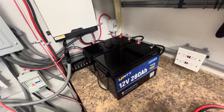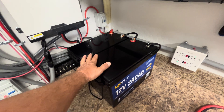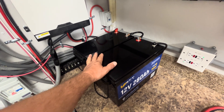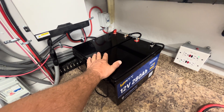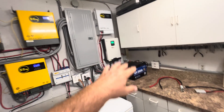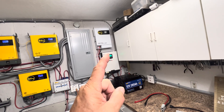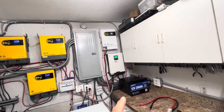A 7-kilowatt setup would be enough for me to run my garage overnight and keep it at 76 to 78 degrees. It was 114 to 116 degrees outside yesterday, and the overnight low was 92°F. With two inverters running, generating heat along with the fan going — that one uses about 70 to 75 watts idle overnight, and these use around 50 watts.